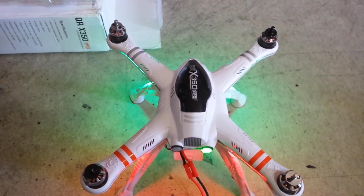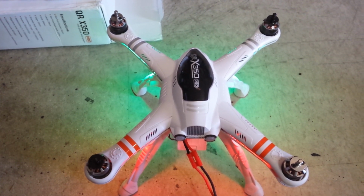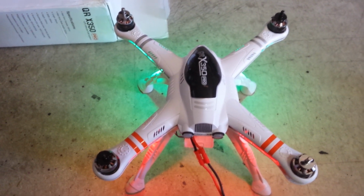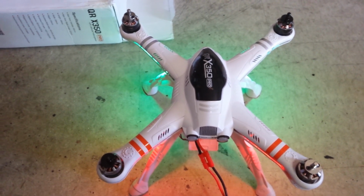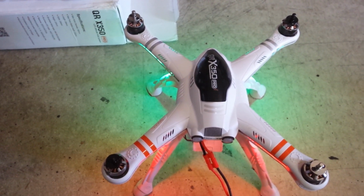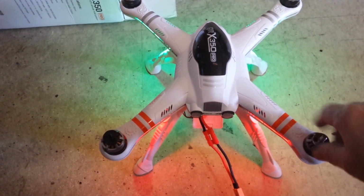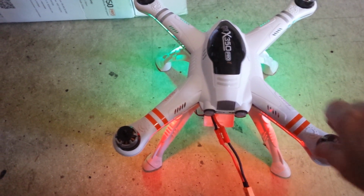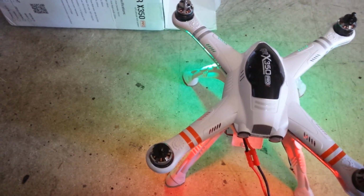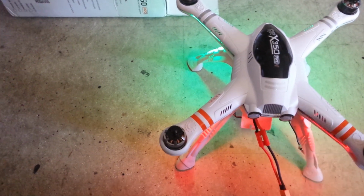Charles McGibney's Walkera X350 Pro that came into the shop. They did the powertrain mod, and then after calibrating the ESCs, they would try to throttle up, and the two front motors would start first, and then depending on how the accelerometer was calibrated, one of the two back motors would start first, so you'd get these two starting up. Then the higher you get with the throttle, this one would start. But I calibrated the accelerometer, and these two swapped.